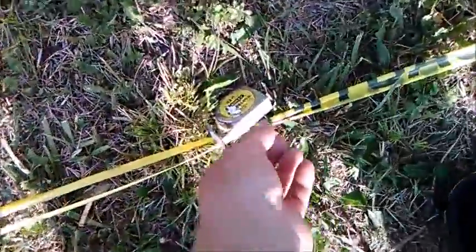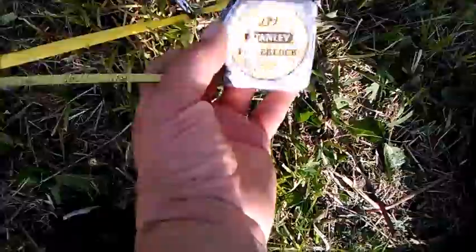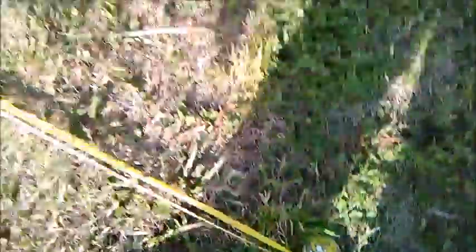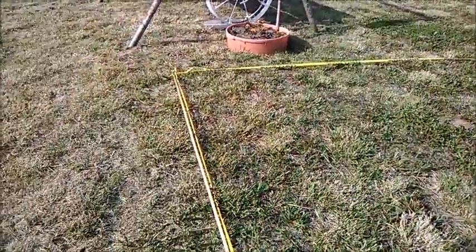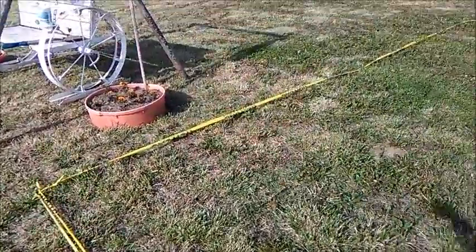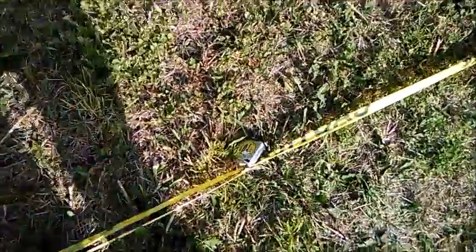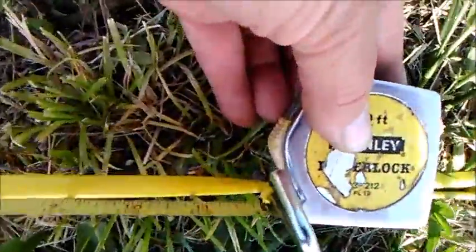This is a 12-foot measuring tape and I want my posts 10 feet apart, so I use this little button right here, lock it at 10 foot. I started with that corner right there where I want the corner of the building to be, went across and down. Coming to the last one with this locked at 10 foot — make sure when you put it up like this it'll lock right in there on the 10-foot mark.